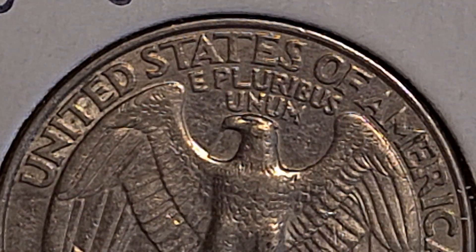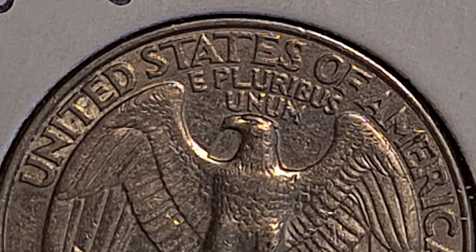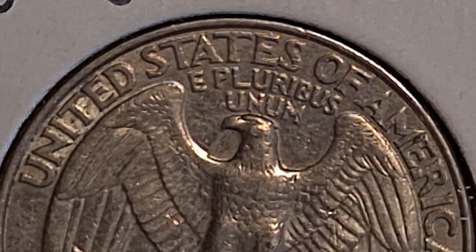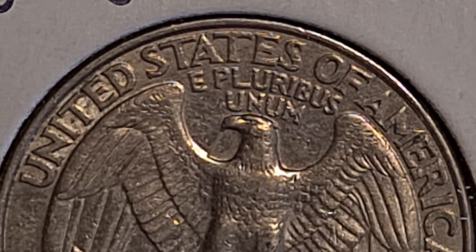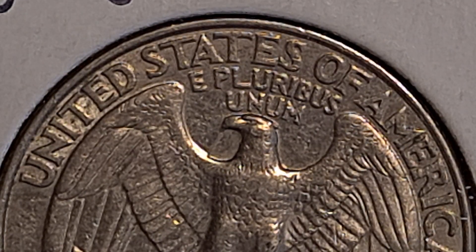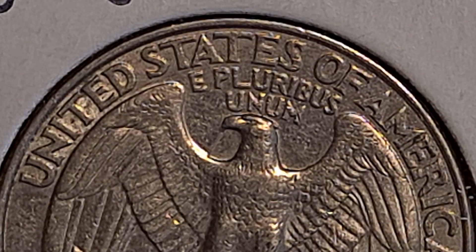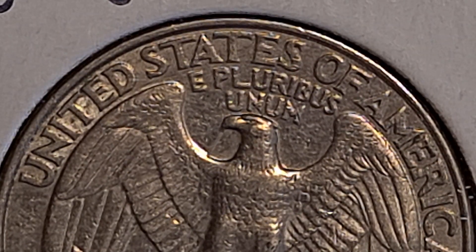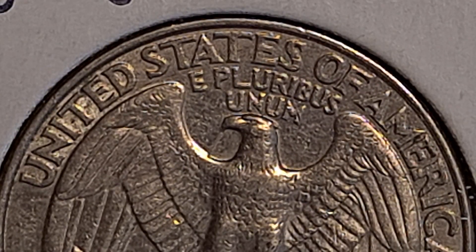So, the two dies, as I said, had struck together, and when the planchet was put in between the two, then you have this result — the planchet having a die mark put on it. Some say that this is actually an imprint of Washington's throat, his neck. The part that we're seeing coming out — I think the word is 'superimpose' — the diagram of the reverse and the obverse. And when they slam together, they present this clash that we're seeing.